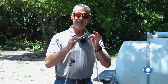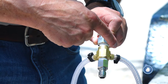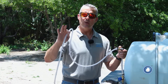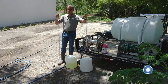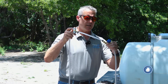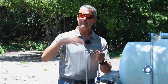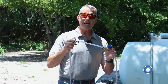But if you use our downstream injection kit, which is a dual port downstream injector, we put one side into our mix of bleach. Normally a 50-50 mix, but it depends on how you're applying it and what you're putting it on — you need to decide what that strength is. The other side goes into our mix of Apple Blossom. On this downstream injector kit is a metering valve that allows us to dial in the mix of Apple Blossom we want to blend with the bleach as it goes onto the surface, so we get the maximum benefit of the color marking dye.